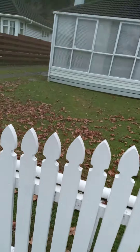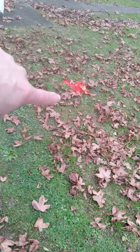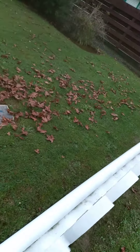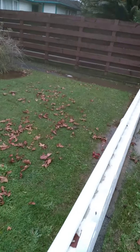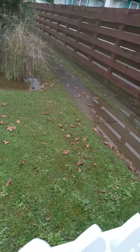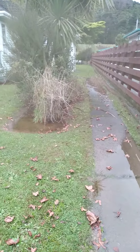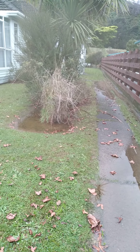She's only about 200mm deep to 150mm deep, so if you dug up the pipe from there and followed it back, you could actually run a field drain along the front here — there's a soakage pit — and then maybe take a field drain all the way up to the other end. But you're running really shallow and the ground is really flat.